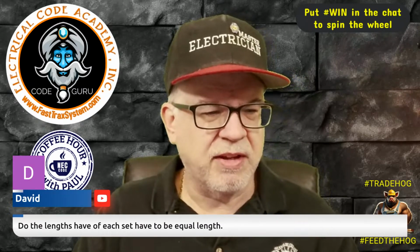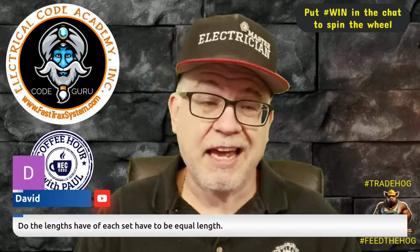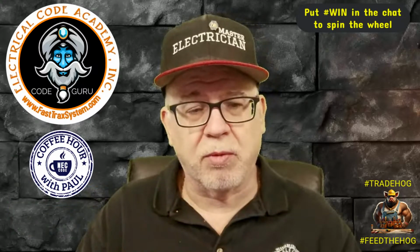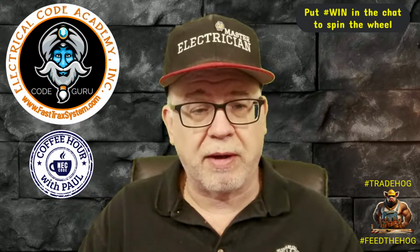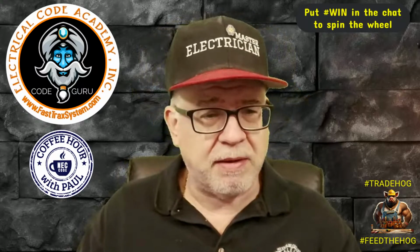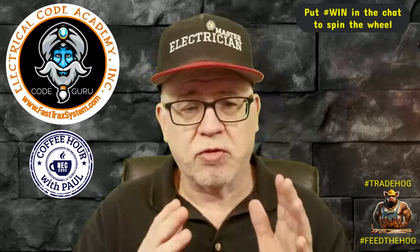David says, questions probably a follow-up. Do the lengths have to be equal length? Yes. So all of the A's have to be the same length. This is an add-on to the paralleling requirement that we were just talking about earlier for Alejandro, I believe. All the A's have to be the same length. All the B's have to be the same length. All the C's have to be the same length. It's because of even distribution of current.